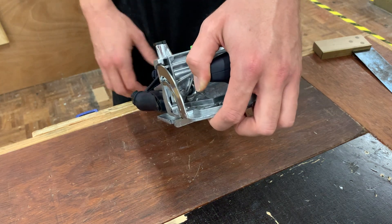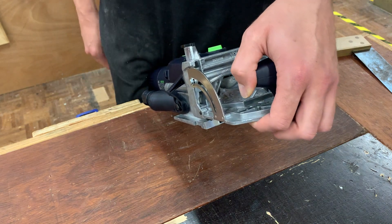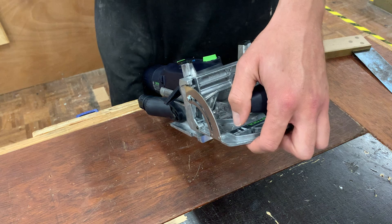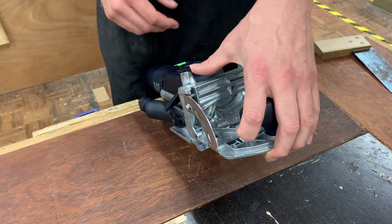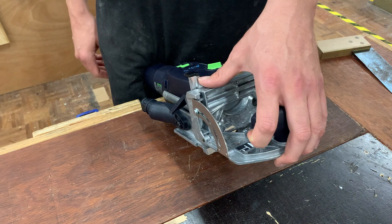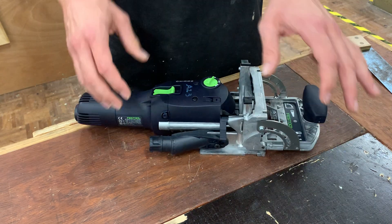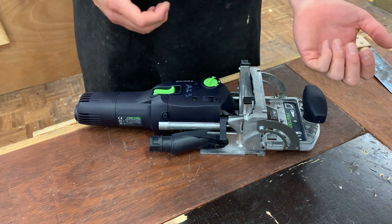You're always to clamp your piece, and yes it takes a bit more time but safety is key. We also need to be wearing glasses as always — we're in a workshop — an apron protecting our clothes, and earmuffs because the noise is so loud. You must have the extraction on because otherwise the dust is too much, and you must also have your hair tied up in a bun if it's long, and remove any rings and bangles because you don't want them getting caught on anything.